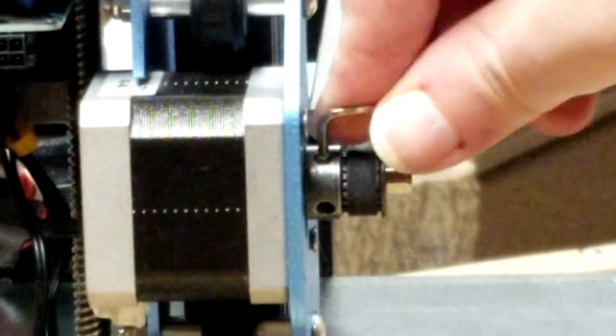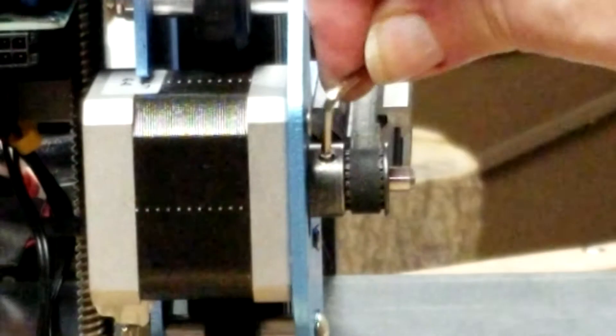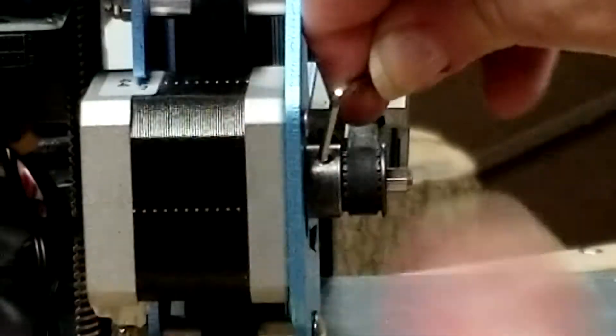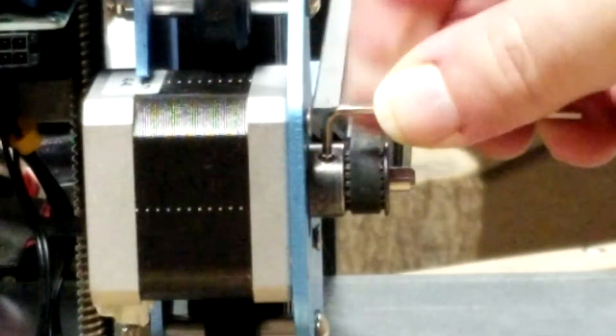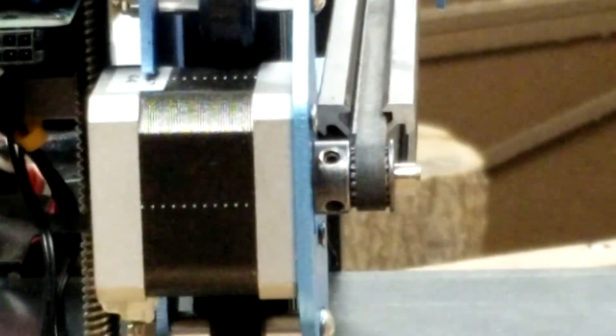That is more than within tolerance. This is not an incredibly accurate machine, and within tolerance that is probably within a millimeter or two, plus or minus on an angle. For this size, that's fine. If this was bigger, that'd be a problem — I'd have to be more finicky about it.